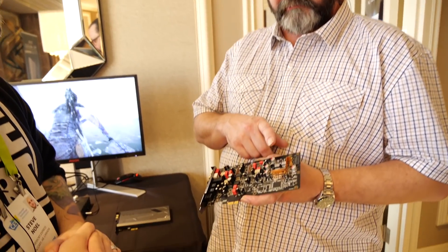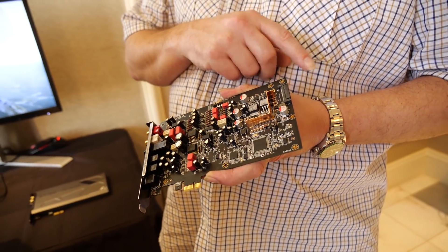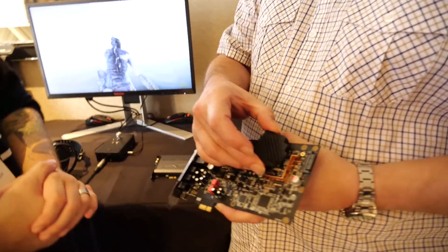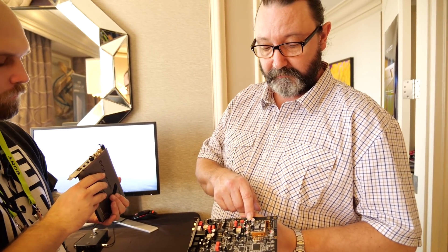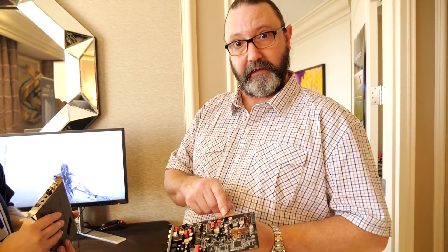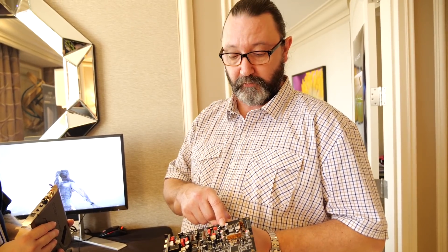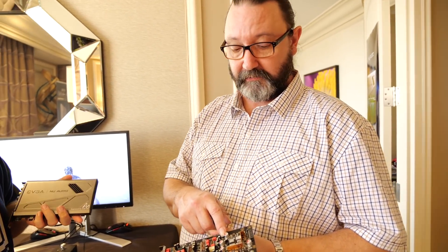From there, we've got a triple regulated power supply, taking clean power for the audio circuitry from the ATX power supply. You can see the regulators under here. There's a little heatsink that normally would sit on there, but we've taken it off so you can have a look underneath. There's also heatsink access screening for the DA converter there, which is an AKM chip, AK4493. It's capable of 24/384 in this format, it's a 32-bit internal architecture, and also native DSD — which is very unusual for an internal card. In fact, you can do DSD256.